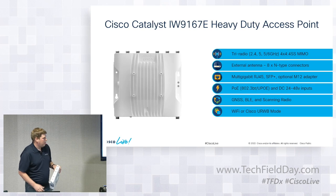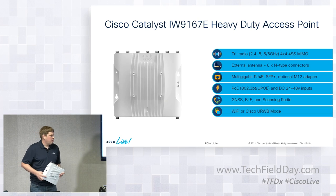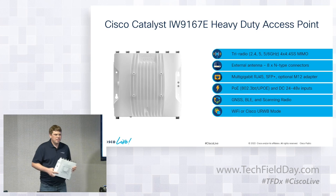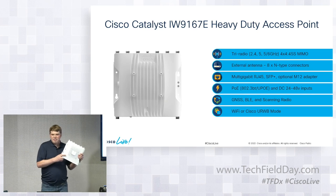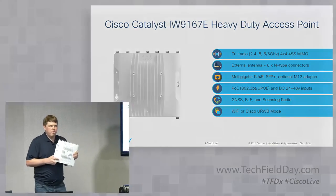As you may have already seen here at Cisco Live, we just released our new line of access points — the Catalyst 9160 access points. This is the top of that series: an outdoor access point with three radios — a 2.4 GHz radio, a 5 GHz radio, and a third radio that does either 5 GHz or 6 GHz. 6 GHz is still pending government approval depending on which country you're in, but you can use that third radio for 5 GHz until that point.